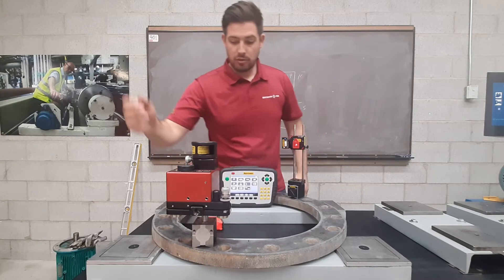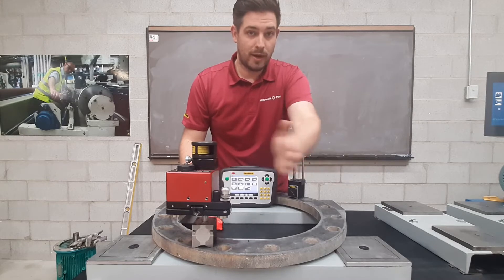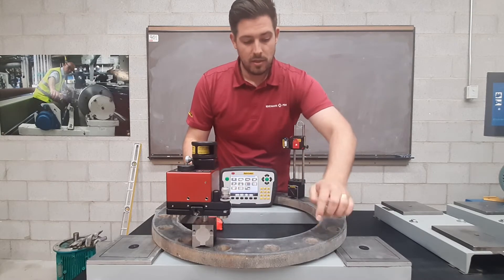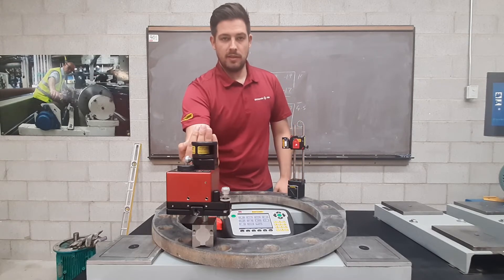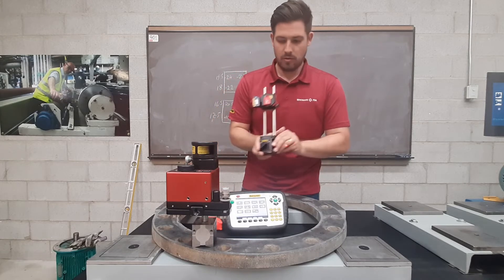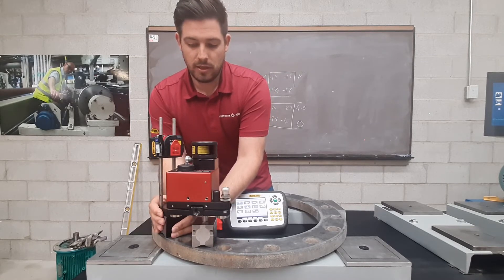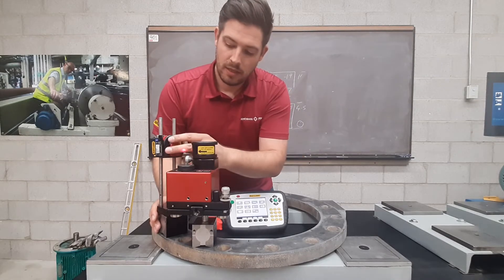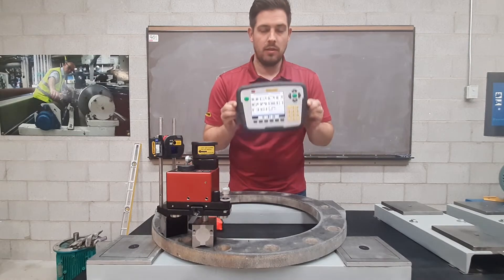I've marked out the measuring points on this flange. My first measuring point is right here close to the D22. The second one is over here, more or less square with this side of the D22 — I can adjust it using this screw. Point number three will be right here, square with the face of the D22 on this side, using the screw here to adjust the laser in that direction. I'll move it to position one, turn the measuring unit so it's square to the D22 wherever the laser comes out, turn the D22 so it hits the red target door, then take the target door off so it reads into the detector.